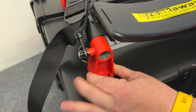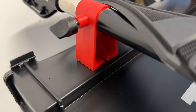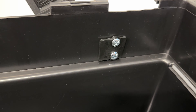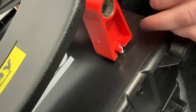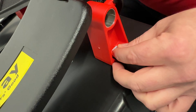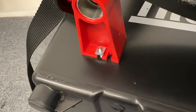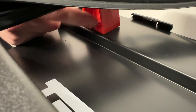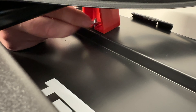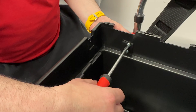Position the conversion so that the red blocks sit over the holes you have drilled, ensuring that the bolt brackets are in place inside the box. Push each bolt through and add the nut to the opposing side of each bolt so that it locates within its recess. If you have a new style Shakespeare box you will need the SB2, which attaches in exactly the same way. Tighten the bolts from the inside of the box and you're done.